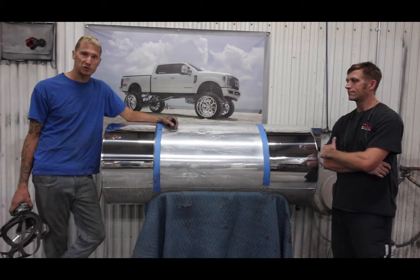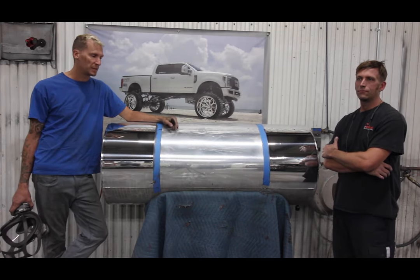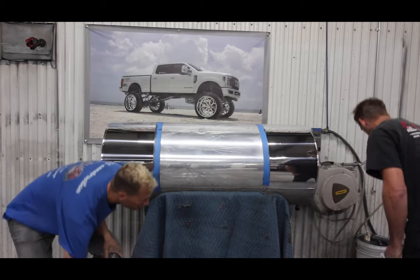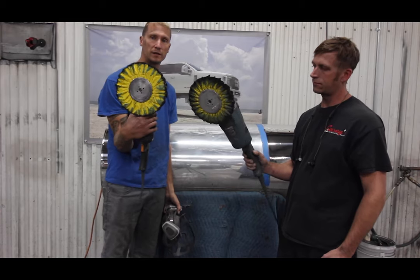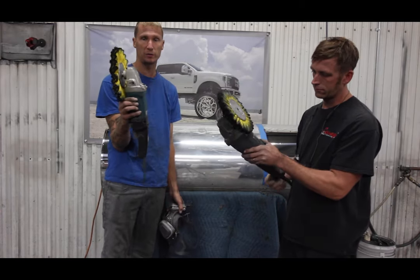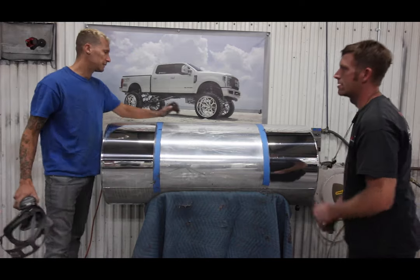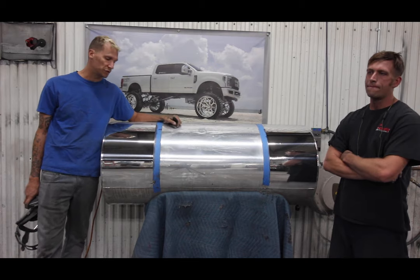Once again, the grinder is a GA7021. That's a 6,000 RPM set speed. In the manual, it says 6,500 RPM grinder. Case, if you want to grab yours, you can see the difference in size. It's definitely bigger. Sideways, weight-wise, it's about double the weight of a variable. And variables are safer. I can say it 1,000 times, but we spin 6,000 RPM on everything except for our white buffs here in the shop.